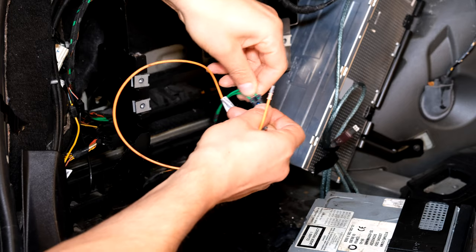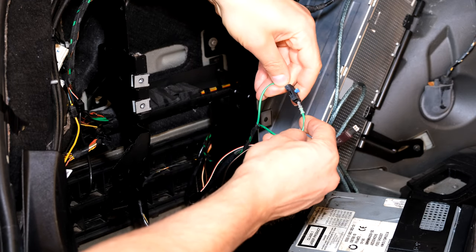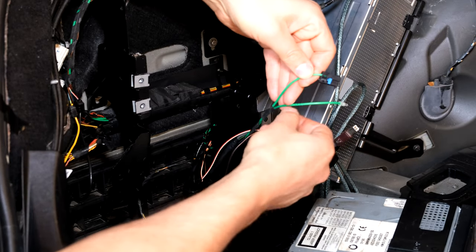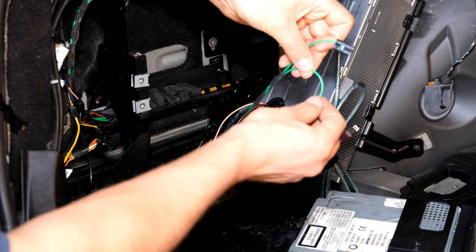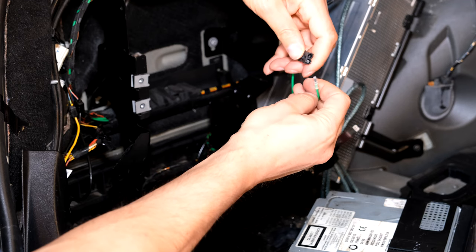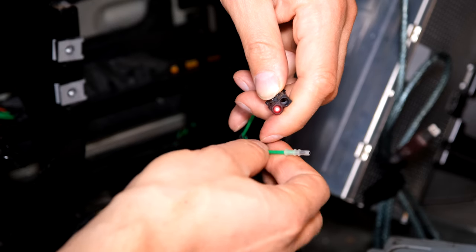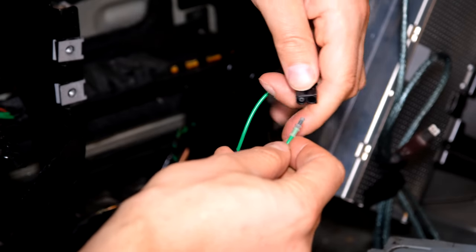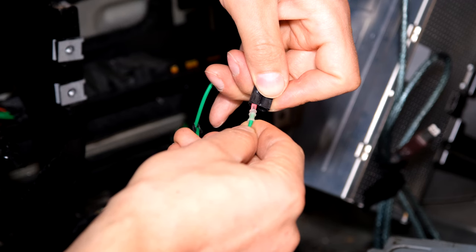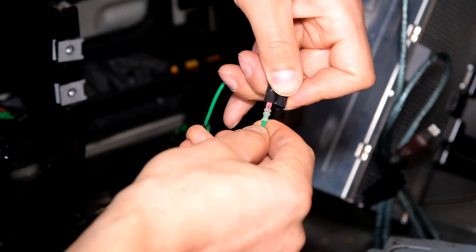That also means you can make your own loop — open both if you want, take the other one out, and just don't do harsh bends; fiber optics must not do 90-degree bends, keep gradual bends. Then put these two together and you should be able to see which module is giving you the problem. The red light is flashing telling me there's a problem — obviously because I've opened the ring. Here's the other side of the ring, and if I put it like that, notice it will stop flashing.